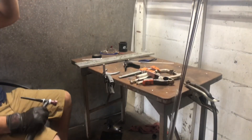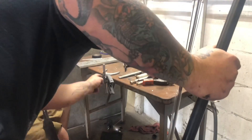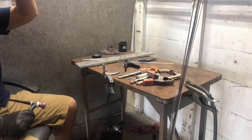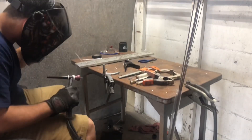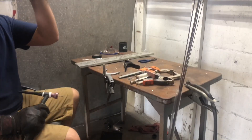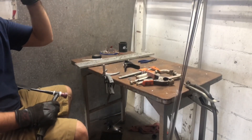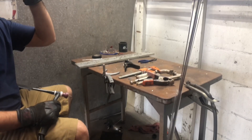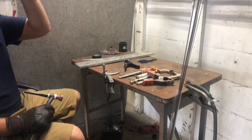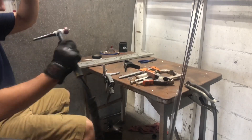It came out pretty good. I'm going to try to find the middle between both of us. You're going to go really slow with steel — it's not like aluminum where you're going to blow holes in it, so the slower you are the better. You can see how big the puddle is; don't just look in front of the tungsten, look behind it as well to see what the actual puddle looks like — that's how you can tell how much heat you're applying. If it starts to sink in, it means you're too hot.